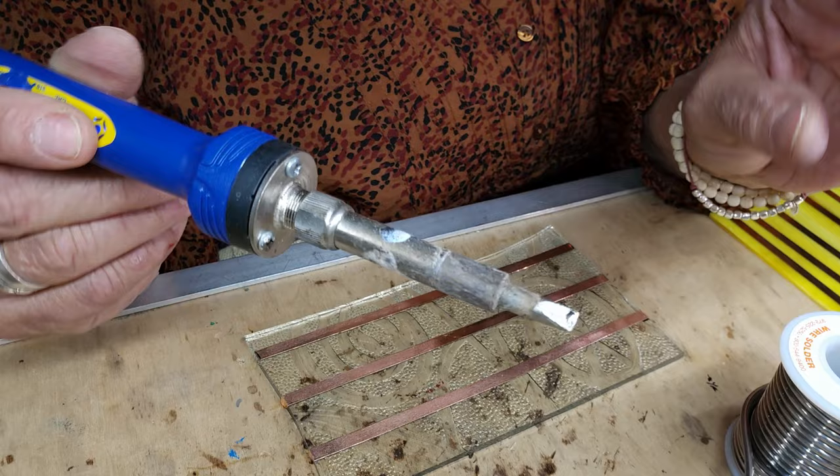Let's give this one more try. Let's not break the glass this time. That doesn't happen when you've got two pieces of glass, but I'm putting extreme heat to this. Once again, I don't run solder because I find it's a waste. And if you don't have enough flux on there, just go back over it one more time. Now I'm going to go back over it — going nice and slow. You can see how I'm holding my iron too, it's flat. I'm just going to run that line.